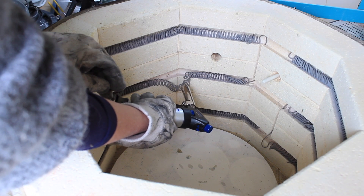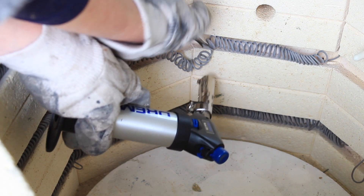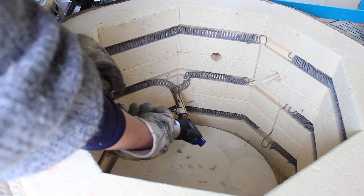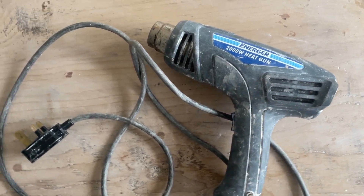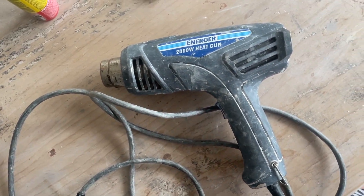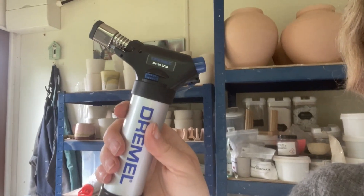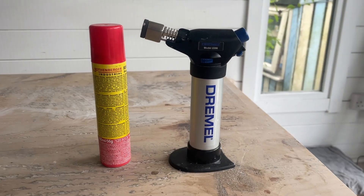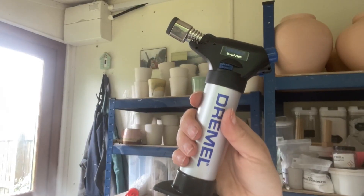You need to really heat them up until they get red hot — then they will get soft and bend back into place. You don't want to do this by turning on your kiln; that would be a very bad idea. A heat gun just doesn't get hot enough. You need to get the big guns out, namely a blowtorch. I picked this one up from Screwfix — Home Depot will have similar. It's a mini one, so not quite as scary as a full-size one and a little bit cheaper.